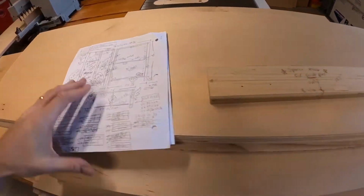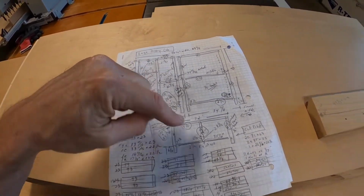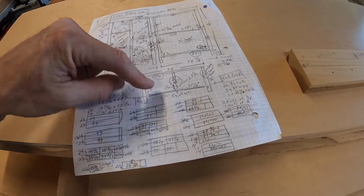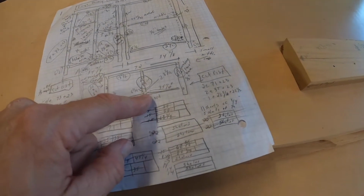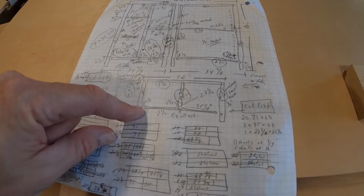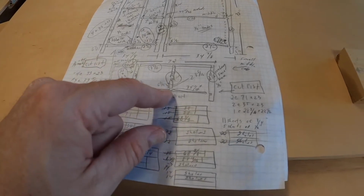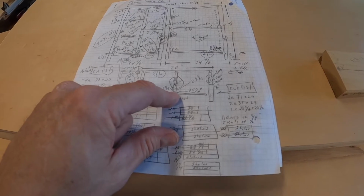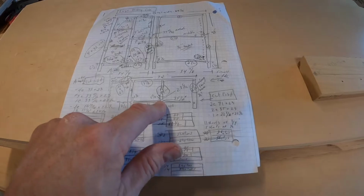Let me show you. These all have dividers in them, right? The vertical divider right there, and the lower cabinets have those dividers. When you have dividers that are in dados, that means they're sitting down further than the top of this dado, which means I'm measuring from the top of the dado up 5.5 inches on center. This one, because it goes down 1/4 inch, I actually have to measure from the bottom of that piece up 5 3/4 to accommodate for that 1/4 inch deep dado.